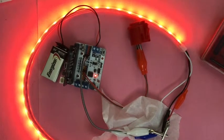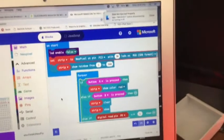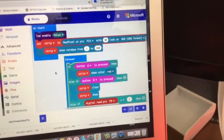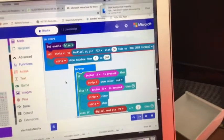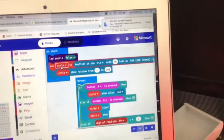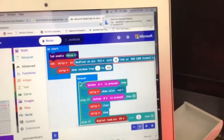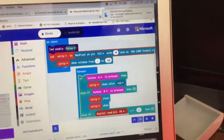Let's peek at the code a little bit. I wanted to make sure I eliminated some conflicts, because pin 9 that I'm plugged into is actually one of the columns of the LED array. So I had to disable the LED array. I had to set up a strip — that strip's a variable, I could have called it anything — to tell it there are NeoPixels on pin 13 and there are 30 of them. If I only tell it there are 20, only 20 will light up. Then I started off by showing the strip of rainbow.